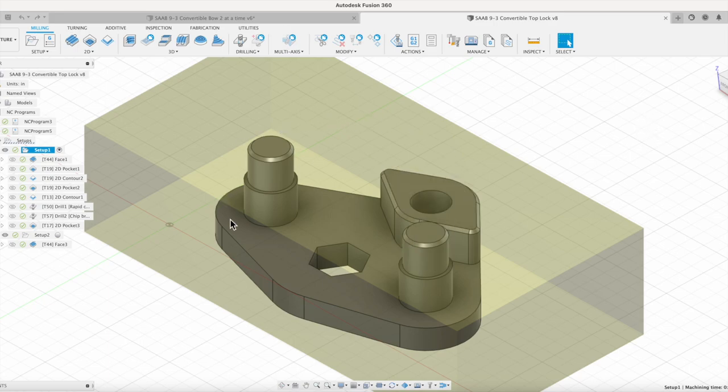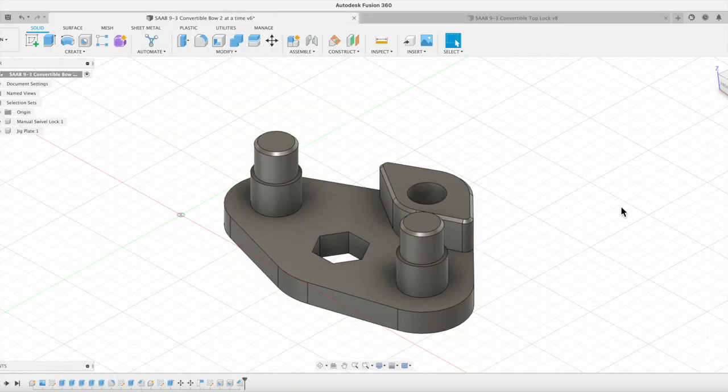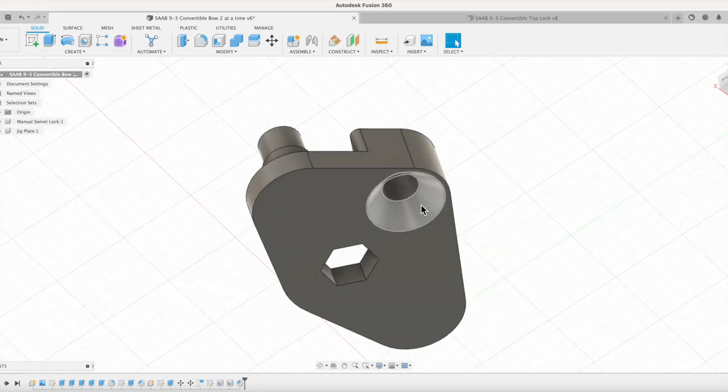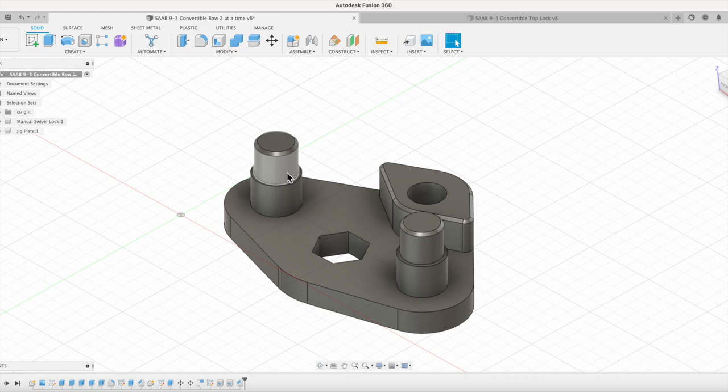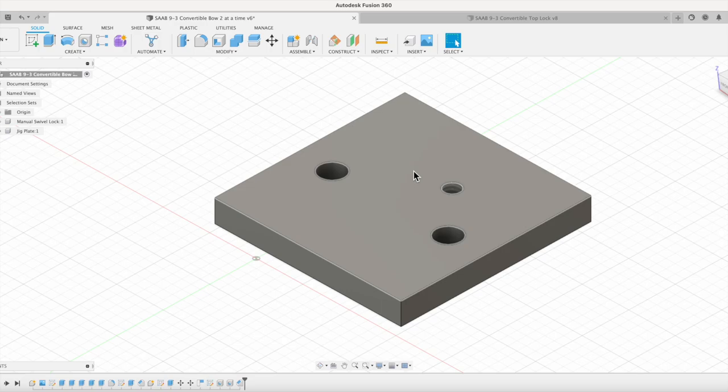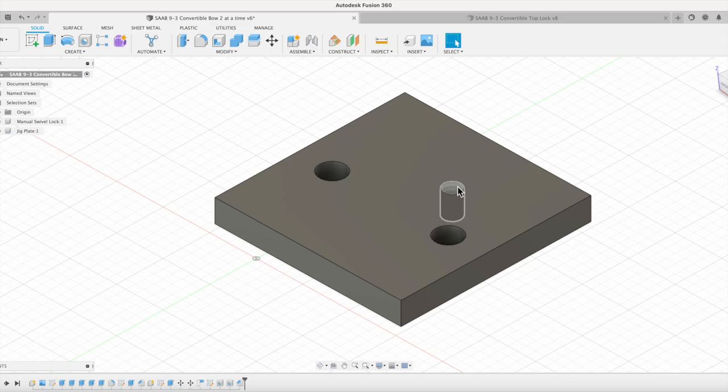So what did that look like? I duplicated what I had here into another drawing in Fusion, and started making my adjustments from here. First thing that I did was add the counter bore onto the backside so that we could machine that. Also, I think I adjusted the size of these posts slightly. They were just a little bit off on that first drawing. So we tweaked those, then created this jig plate. As I mentioned before, with the other part I first flipped it over and just manually cut the counter bore in there. On this one, we want to be able to flip it over, machine the backside of it, and then after we machine in the counter bore, I'm going to be able to bolt it onto this plate. I've got the two alignment holes for the posts.